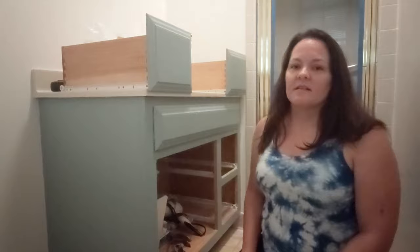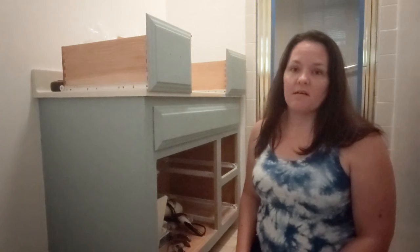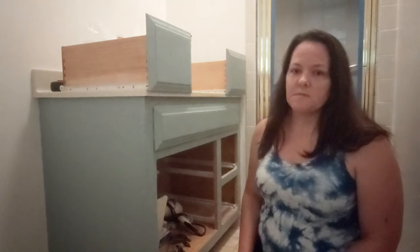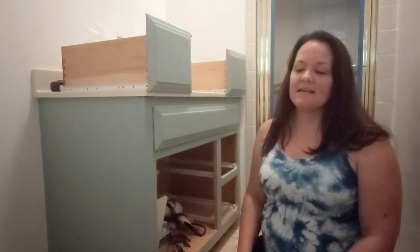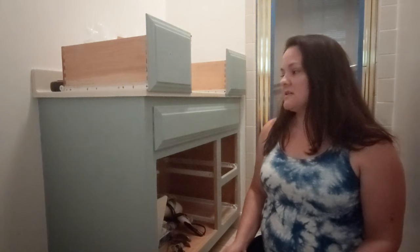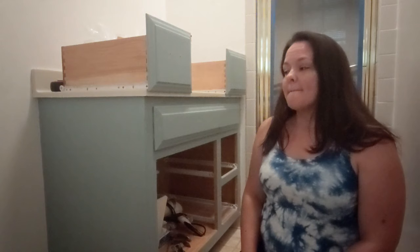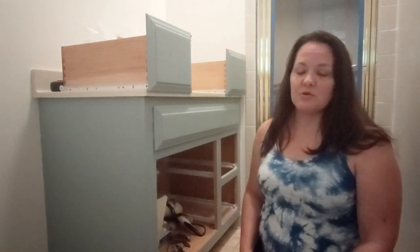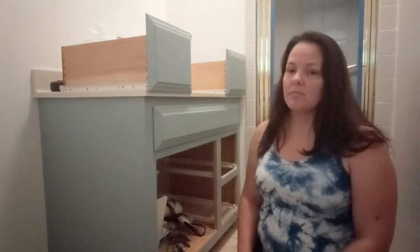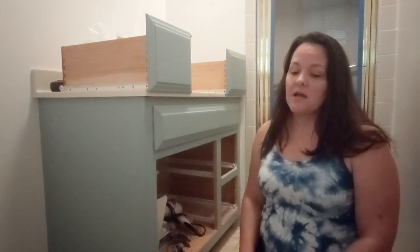My vanity is all painted. I did two coats of General Finishes Milk Paint, and it covers really well, so two coats was plenty. Now I am ready to do the sealer. I really considered skipping the sealer because this paint technically doesn't have to be sealed — you can leave it with just the paint finish and it's durable, it's not like chalk paint. But General Finishes recommends only leaving it unsealed if you are painting something that isn't a high-use or high-traffic surface, and I think we're going to be opening and closing these drawers and cabinets pretty much every day. So to be safe, I think sealing is the right thing to do.